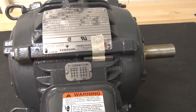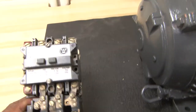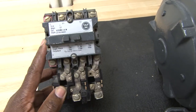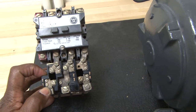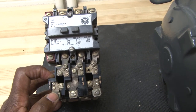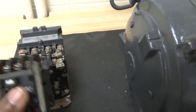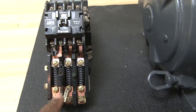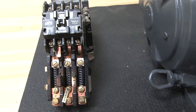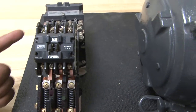One of the controls you need is a contactor. This is one style of contactor, but more particularly we call this a motor starter because it has a contactor at the top and motor protection at the bottom, which uses heaters or other devices. Newer ones use electronic circuitry in case it's pulling too high amperage, but the old ones use electric heaters. You can see the heaters better here — this little electric coil in each leg will heat up when current is high and generate heat, and there's a bi-metal switch below it which will trip and open the controls to de-energize the contactor.